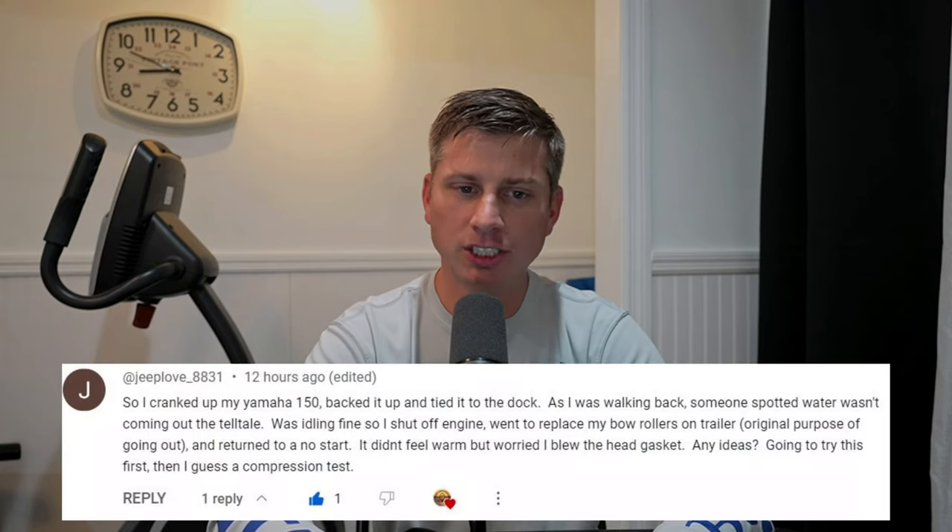Run the Salt Away in there — the thermostat will open, it'll clean up any kind of buildup that's occurred over those months. After that you only have to run it for a minute or two and that'll be plenty of cleaning. You won't risk overheating the engine or causing issues with your impeller. That's what I would suggest if you want to be as thorough as possible when flushing the outboard.